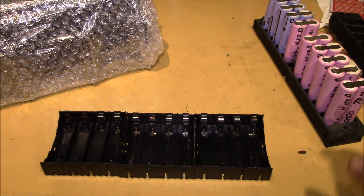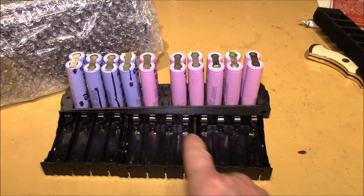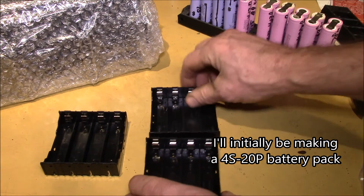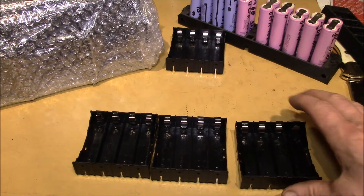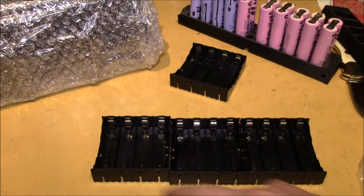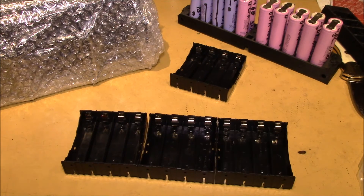I'm going to use his idea of the power shelf and build myself a battery pack using these cell holders to simulate my permanent setup. I'll put 10 pairs of cells in here, wire them up — I've got some nickel strips, probably use that, run a nickel strip down here. I'll make a four-series pack, at least initially, using 10 out of the 12 positions. I'll have four sets of three holders and populate ten positions with my cells, put that in my system, and hook it up to my solar charge controller.